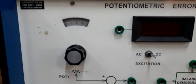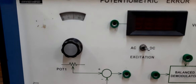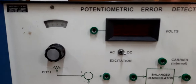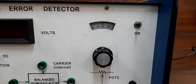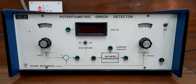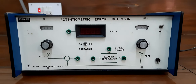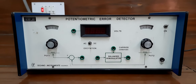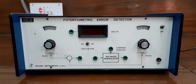You can find here that there are two potentiometers. This is pot 1, which is adjusted at 0. It is a circular type of construction. Similarly, there is one more pot here, that is pot 2, which is again adjusted to 0. These two potentiometers are of rotary or circular type construction. We know that these two potentiometers are passive transducers, so they will sense the angular position — that is the mechanical position — which we need to sense and detect the error. One pot will work as a reference pot and the other will act as an actual pot.